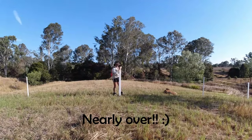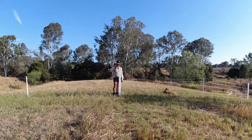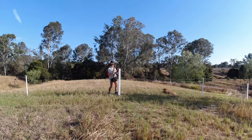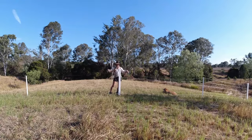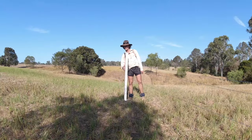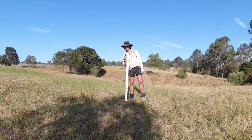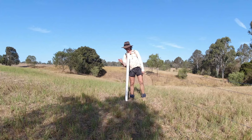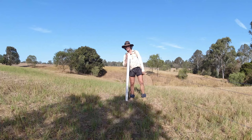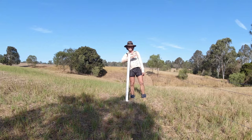This post, when I set it, was leaning out three-quarters of a bubble. You'll notice it's sitting square now. That's vital - to have that three-quarters of a bubble out - because when you're coming round the corner it's going to want to pull that H-post in. So as you can see, the side of this H-post is sitting pretty square now. It was about 50 millimeters, or two inches, out in total. Those five wires strained just hand-tight - not piano-tight - have now straightened that H-post up. Had you started with a straight position, it would be leaning in 50 millimeters.